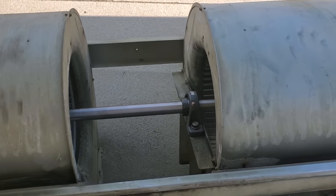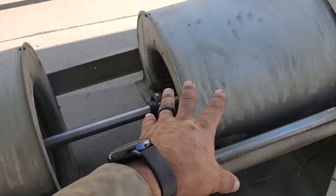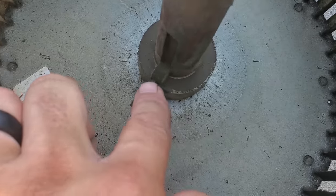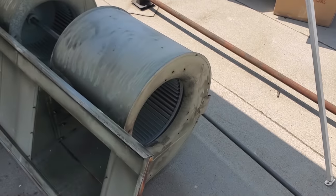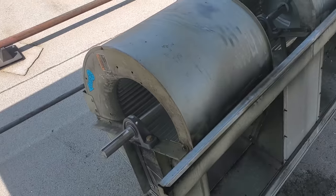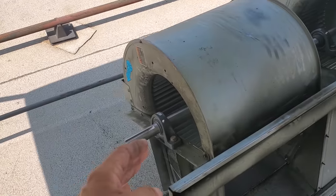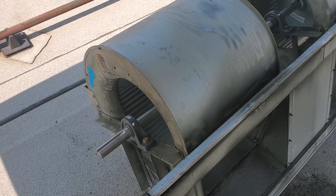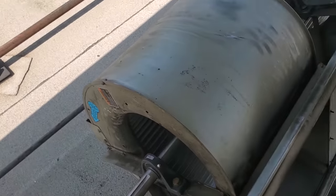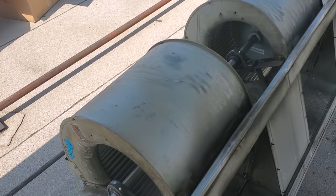We are slowly getting there. What I did was line up the bearings via the dirt line, then tightened those down. Everything is still loose as far as the wheels go. I've got to get the keys out of the old ones because I don't have new keys - I need to slide those out so I can put them in and then set the wheels. You want it to be as straight as possible, that's why I tried to use the existing marks for the bearings. These bearings will self-center ever so slightly. If you don't have it lined up perfect, it'll kind of self-center. You'll know when you start it up - if things don't match up, you might have to move things around.